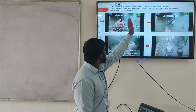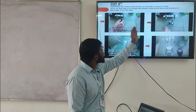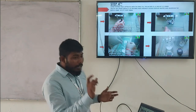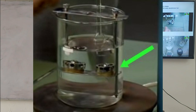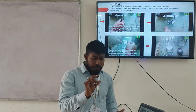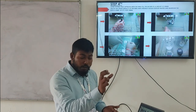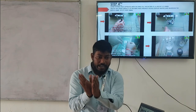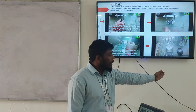After placing the apparatus with the ring, fill the beaker or bath to a height of 50 mm above the upper surface of the ring with freshly boiled distilled water, and maintain the bath temperature at 5 degrees centigrade for 15 minutes. We place the beaker and sample in the bath, keeping the water level 50 mm above the upper surface of the ring using ice to balance the temperature. We also place the thermometer and check that the water temperature is stable, using the stopwatch as well.